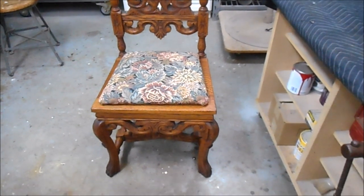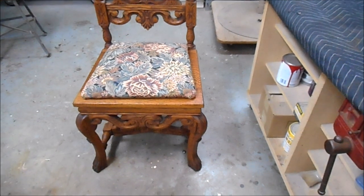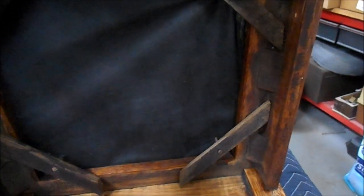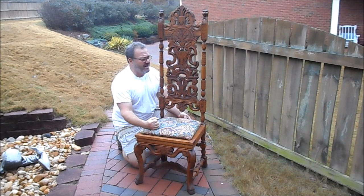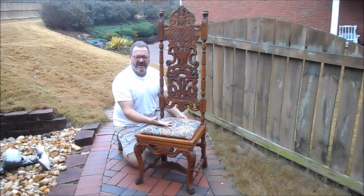Does it look nice? Once you've got it where it is, clamp it down with some soft clamps. Then you can flip the chair over and run the screws in. And the seat's mounted. You can see how the braces that we built work. We ran the screws up through them into the base of the seat. So there we go. Well, here she is, all done. Got a new lease on life. It's as strong as can be, rock solid. It's been re-waxed. Got the seat attached properly, and it's ready for another 100 years of use.